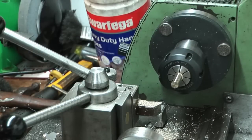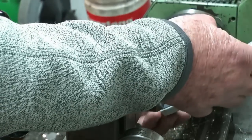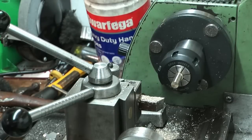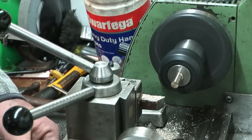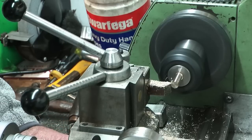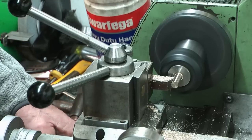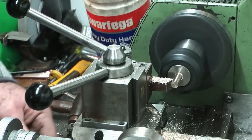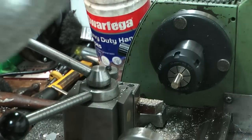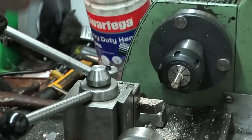Okay, it didn't have much difference — reading 8.185. Let's just verify that: size is 8 — measuring 7.987. Okay, that's close enough. So this has got to be 6.1, pretty much now. I've already got a zero at the end. Going to 12.4 — I'll go to 12.3 to start with. I'm looking for 1mm on my DRO, which will take the 2mm off, but I'm going to stop about 0.1 up again, so I'll stop at 0.9 on my DRO. Going to 12.4 now — that's the 0.9 reading. I'm expecting this diameter to be about 6.2 as it stands. Reading 6.1.